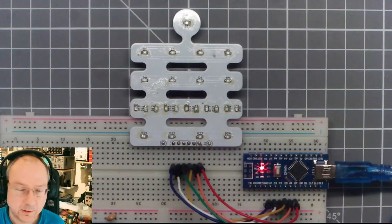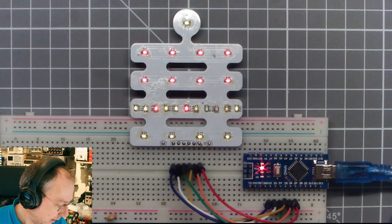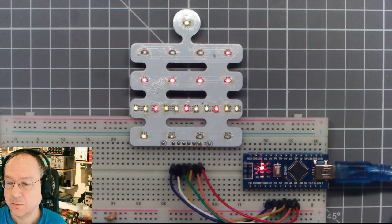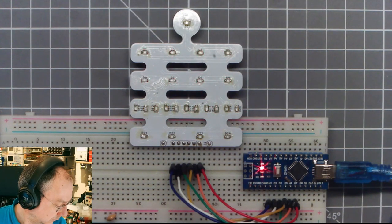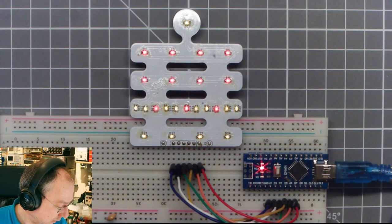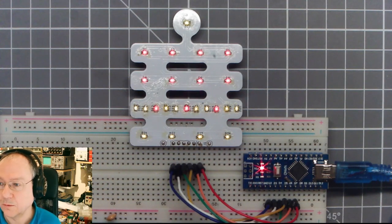which should give every LED 1 or 3 milliseconds of on time. It is actually even more flickery to the eye than it is to the camera. So 3 milliseconds is obviously not a good choice here. Let's try instead 1 millisecond, 3 times faster. So this would be 1 millisecond. It looks a bit flickery on the screen, and it also does still for my eye.